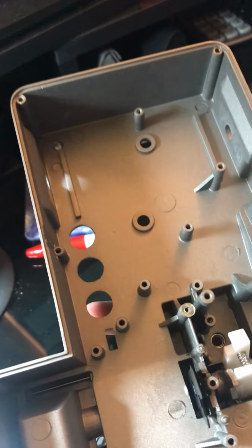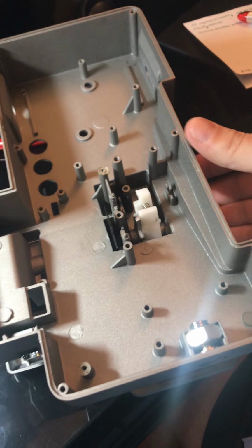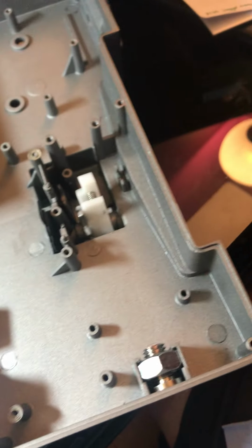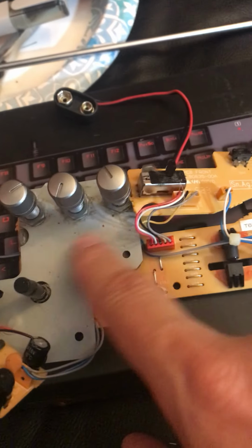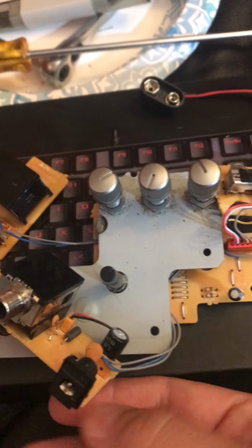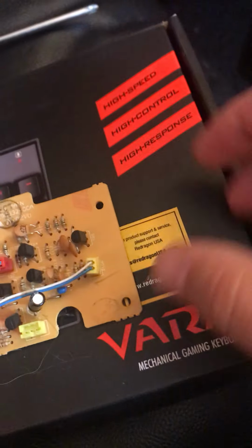But yeah, coming along, so we're going to move into the next phase of reassembling it, and then from there we'll see if it powers up, if it has any issues. It's a pretty straightforward board. I pulled all those components out. So obviously I'm going to have to still clean around the tone pots, the trim pots, some switching here. I'm going to look at all of the resistors, do a visual on those, make sure that everything looks good on the board.